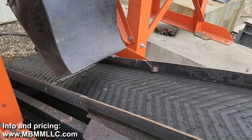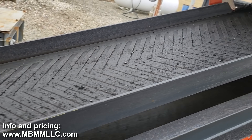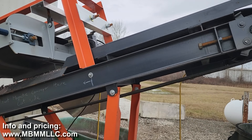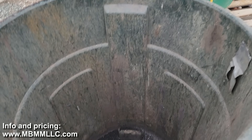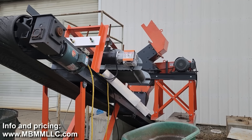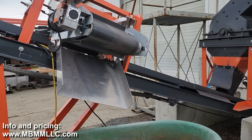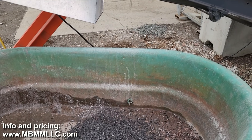It's going to fall out this gray chute onto this conveyor here, come up under this cross belt magnet, and it's going to fling the steel off the other way. All the non-magnetics are going to come up here off this conveyor belt and into this garbage can. All the magnetics are going to shoot off from the conveyor belt on this cross belt magnet onto this aluminum tray, and it's going to end up down in this green bin.